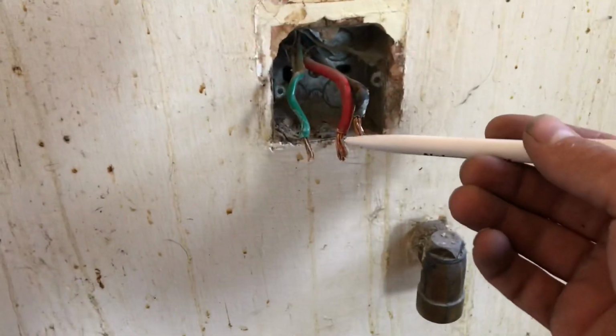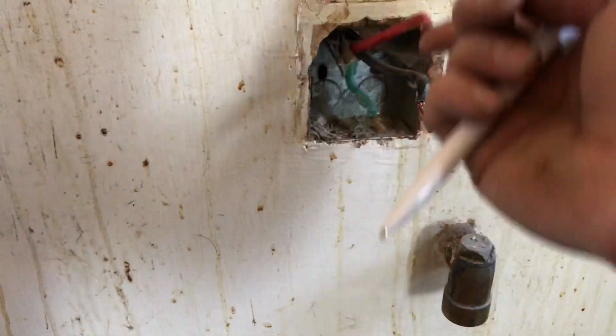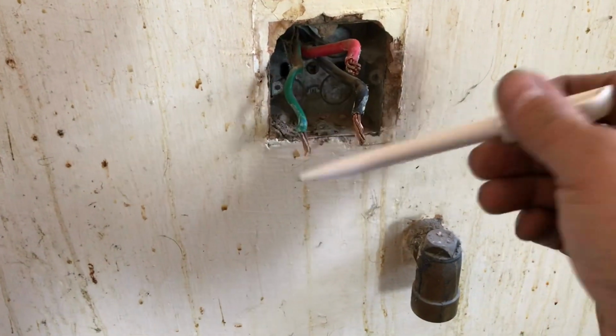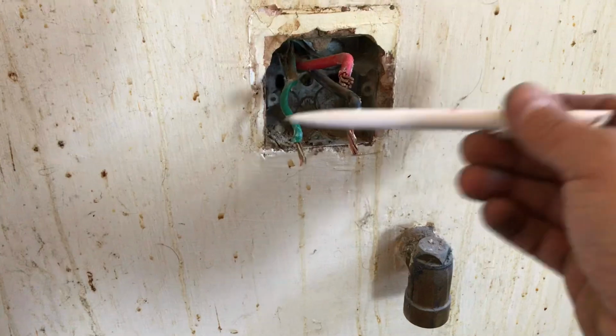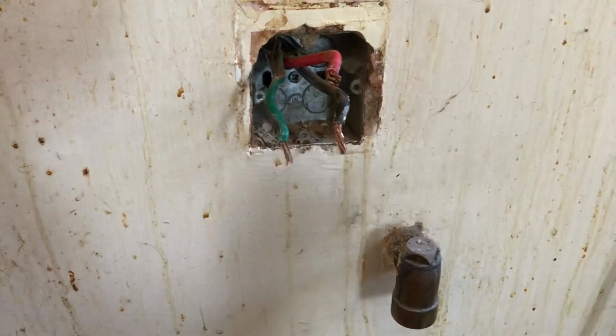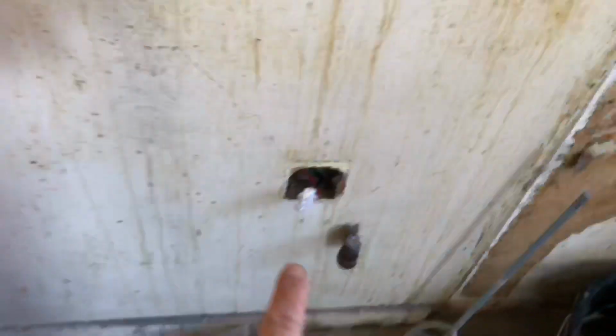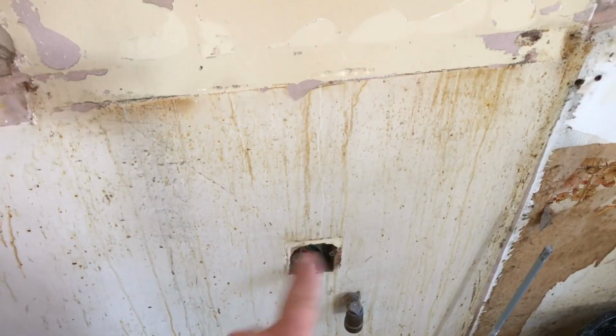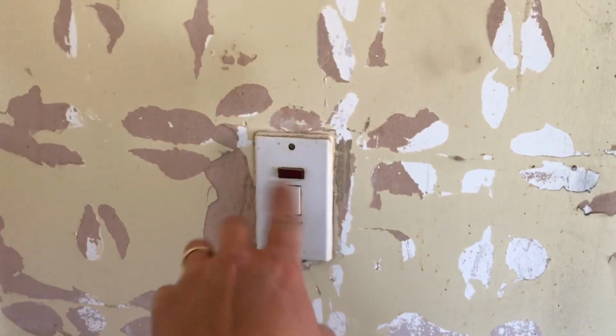And then if you want to, you can go and switch your cable around at the board end. So you'll be going between the CPC and the neutral that come here and measure it and just make sure you've got pretty much the same reading, because it should be exactly the same length of cable. Okay, so all I'm done with this is screw that back, put that in some connectors, I'll put the cover plate back on and I'll tell the client he needs a new cooker outlet switch and he's going to change this anyway, so I'm not bothered.